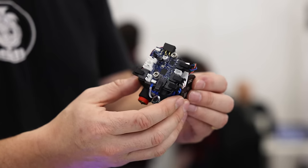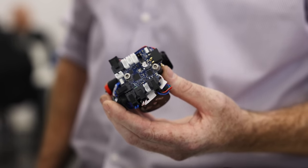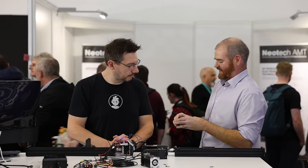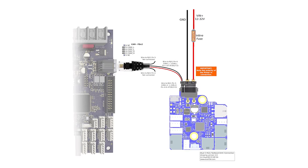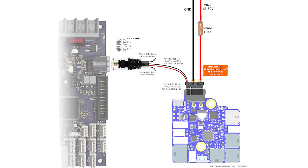Another product on display is the Revo Roto from E3D with a Duet tool board mounted on the back. This is the first tool board Duet designed very specifically for this extruder — all the connectors match exactly what E3D provides, so adding it is just plugging in wires that are already there. No crimping, no custom wiring needed. Like the motors, this board is another device on the CAN FD bus, so adding this tool head only requires running power and CAN FD — two wires each.